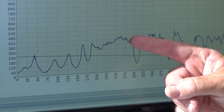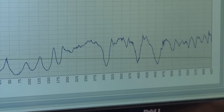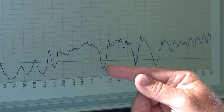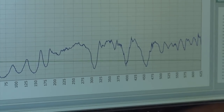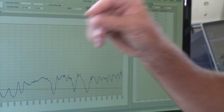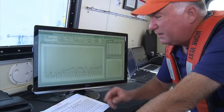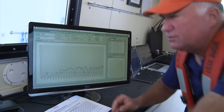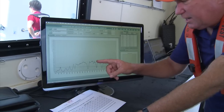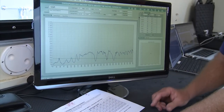The tension slowly increases, and then rapidly declines down to essentially no engagement with the bottom, and then rapidly comes back up. This distance from the valley to the peak is only 16 seconds — about two and a half feet of anchor rode pulled in — yet the tension goes from roughly 90 pounds up to as much as 480 pounds. Then we have fairly consistent tension, a dip, consistent tension, a dip, consistent tension, until the end of the test.